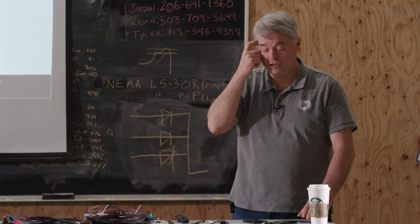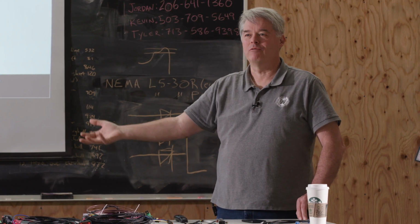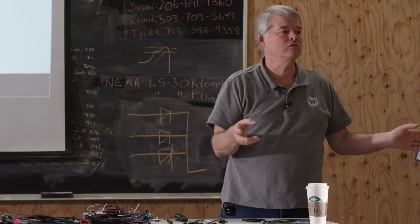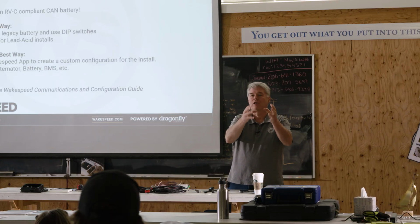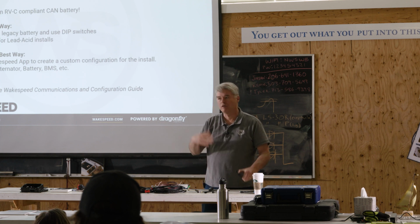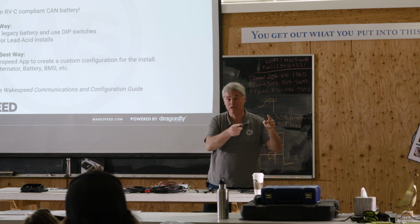The reason why that existed, and this is actually a bit of folklore, way back when I first did this like 10 years ago, a chap was going to write a cell phone app to go with my open source regulator. So I made the regulator and said, we're going to communicate with ASCII. There's a computer science reason for doing that, because it's transportable. Everybody knows what the number 1 and the letter A look like in ASCII. It doesn't matter whether you're on a cell phone or an Apple or a Windows or a microcontroller, ASCII is ASCII and it's universal.